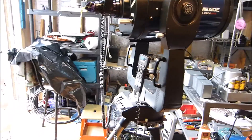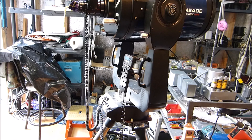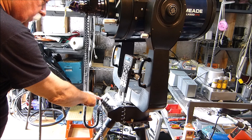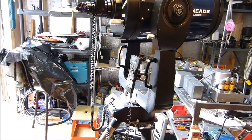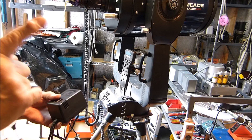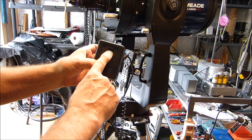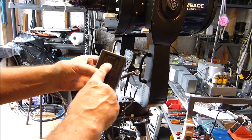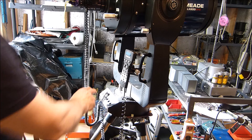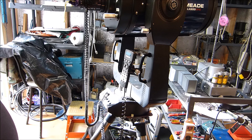What this is about is the information I was looking for: the proper voltage. It says right there 12 volts DC. Some people say it's supposed to be 14. Some people say it's supposed to be 18. I think I've even seen people say it's supposed to be 21. And then the argument gets in there of plus and minus and all this kind of baloney. I think it's a lot of nonsense. Here's what I do — I use this one. It says 12 volts DC out at 1.6 amps. These are unregulated linear power supplies, not switch mode power supplies.